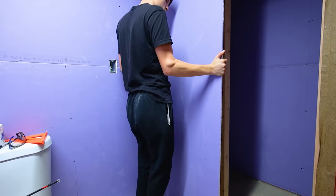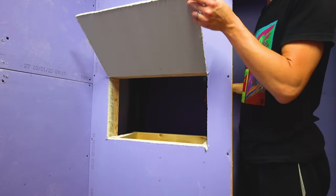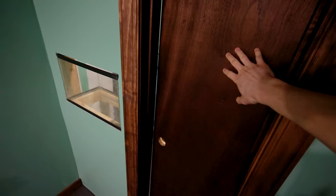I went on to hang the drywall on the front. I marked the corners from the inside, cut along the wood with a keyhole saw, and peeled back the rest. This framed in the tank beautifully. Fast forward and I finished the drywall, painted everything, and added the door.